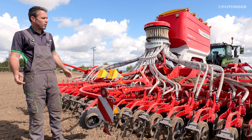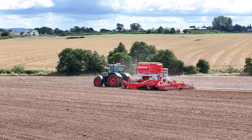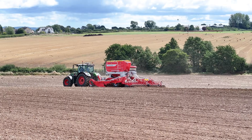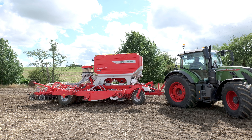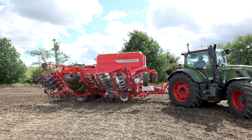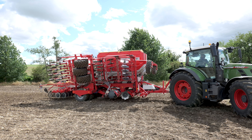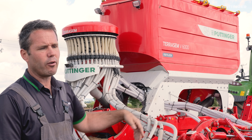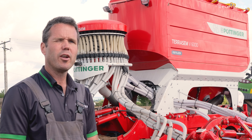What's really nice about how the IDS head functions during tram lining or section closing is that it allows air through and out to the coulters. Previous generations and other brands get back pressure when closing tram line motors because there's nowhere for the air to go, and the seed rate on remaining open sections is highly influenced — blowing seed out of the ground. Our head has a unique feature that allows the air through but not the seed. On the road, this machine folds up nicely — the centre wheels come up so they're not in contact with the road in transport position, giving a really stable feel. We also have air brakes on this drill, which is increasingly important at high speeds, and an onboard air system for maintenance, such as cleaning out fertilizer or different seed varieties.